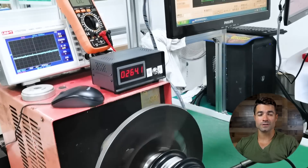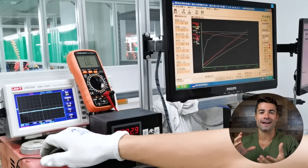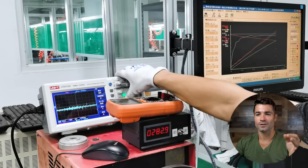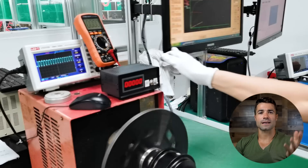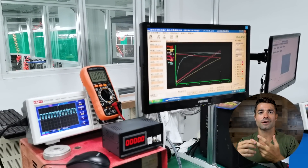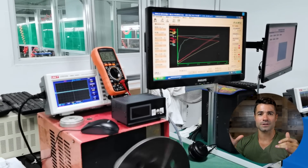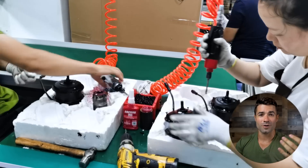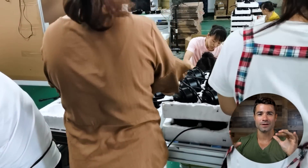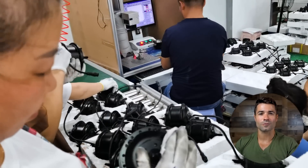As far as building the motor goes, that's pretty much it — but there are still some very important testing steps. The motor is put on a little dyno and you can see how the electricity oscillates between positive and negative, as it's a digital motor. The computer tests for max power, torque, input voltage, output voltage, and efficiency. If any spec is not met, that motor will not be used. After testing, final touches are applied: bolts are installed in the outer motor housing with strong red Loctite, and the motors are cleaned up and prepared for shipping.